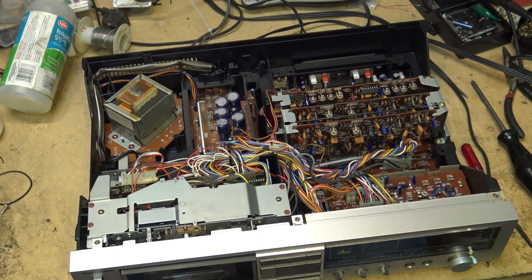I still have a factory tape. I'd just have to go and dig it up. I could go find my factory 3 kilohertz tape and put it in here, and it would show exactly the same thing, because the tape I used to verify this was one I made right after the speed was calibrated. I made a few working tapes that I use. That way, if they get chewed up, I'm not losing a tape that cost me a couple hundred dollars when I bought it initially.